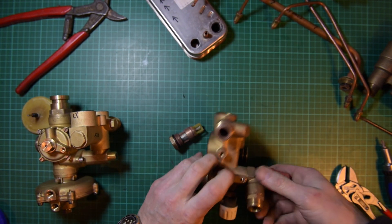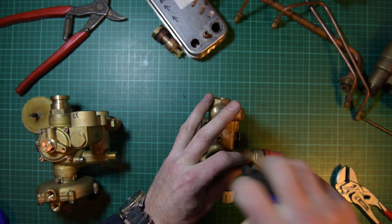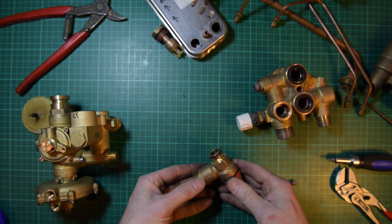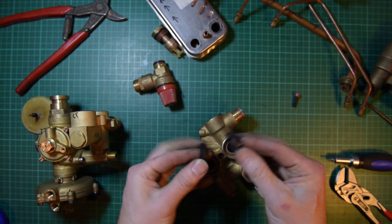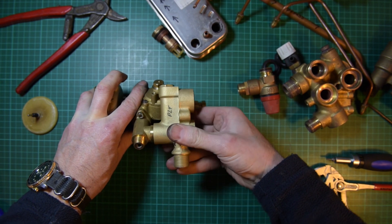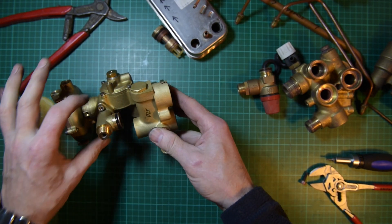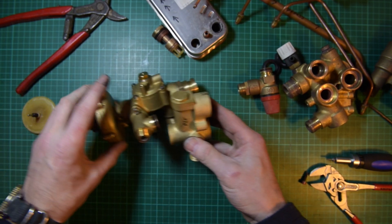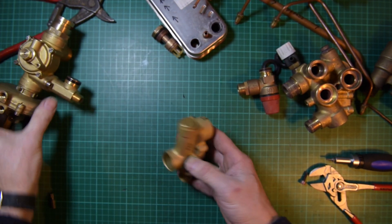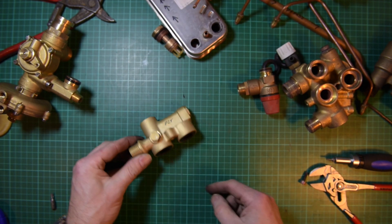Anchorage plate. If you wanted to replace the pressure release valve on these — when new you find they're slightly in the wrong position — just loosen them. There's an O-ring in here, an O-ring on there, and your 3-bar pressure release valve. I've got a couple of large donut-type O-rings on this section. If you were changing any of the diverter, this would stay in the boiler and you would either undo these two or pull the whole body out and replace it, or look at the other video on how to recondition and repair it. There's a couple of screws to gain access, but that's it.